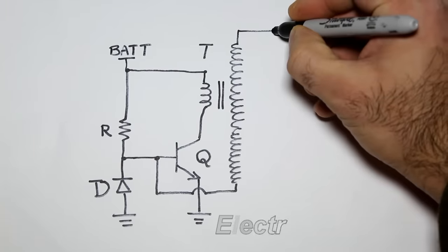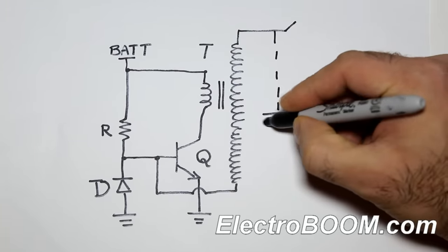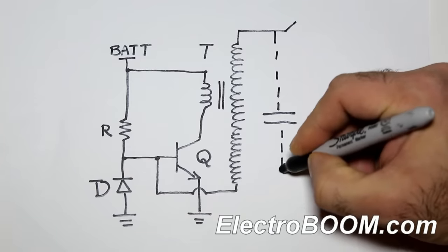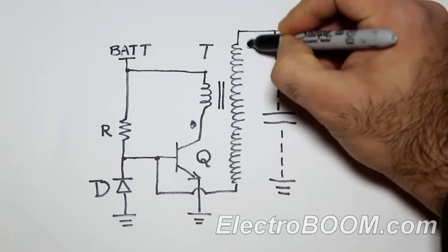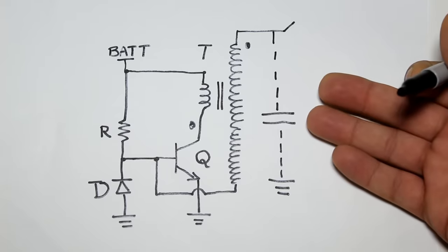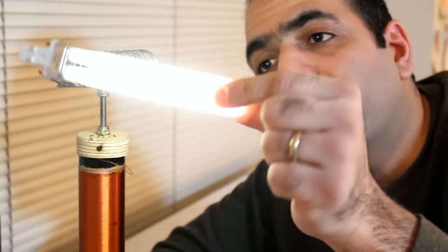After the internet and I pour our brains out, we realize there was in fact an important component missing from the schematics, which is this parasitic capacitor that exists naturally between the secondary winding to ground. It is an extremely small capacitance, but is enough to close the loop and make the circuit oscillate. So this circuit can generate very high voltage, in order of thousands of volts, that can excite the fluorescent material